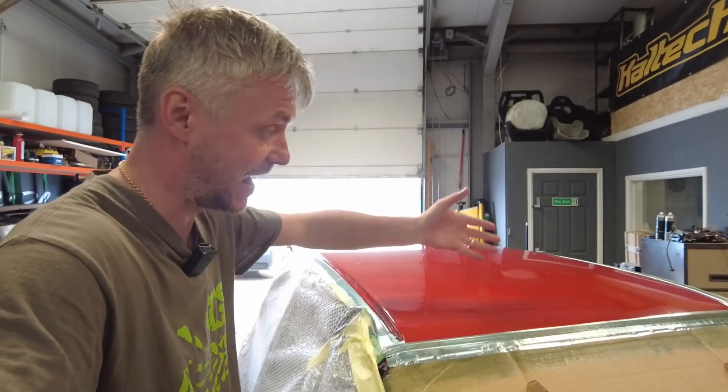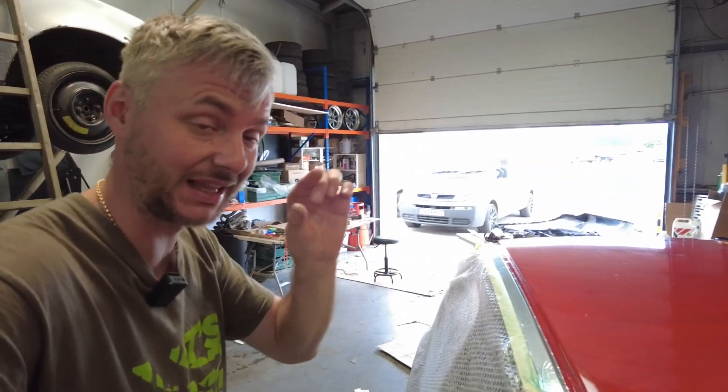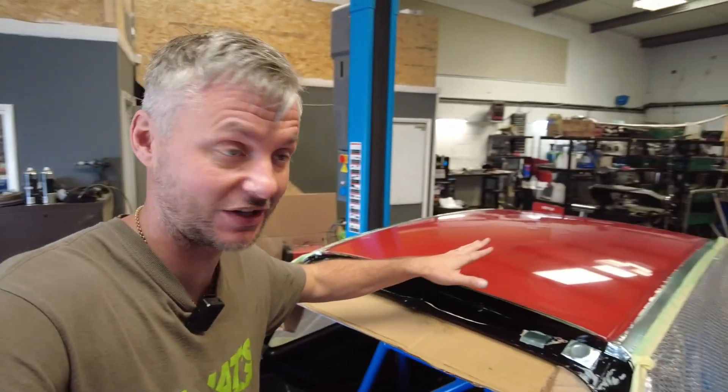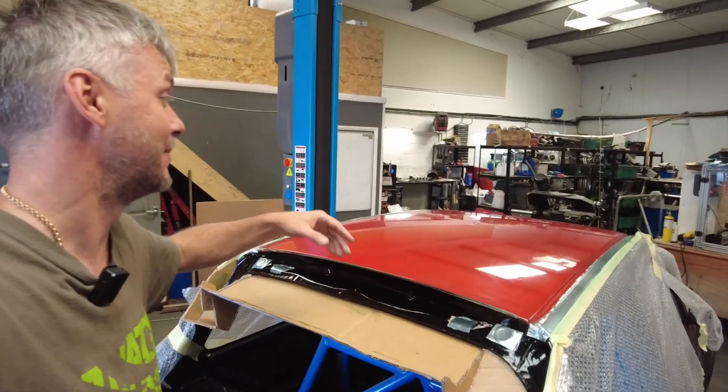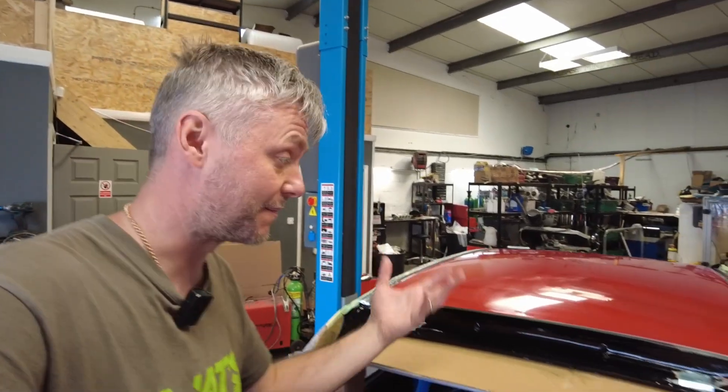You prep it and now you would lay 4 to 5 thick layers of fiberglass and then reinforce it. Actually, first you would obviously put gel coat and then reinforce it — but effectively this is how you make a mold. So we're not making a mold, we're skinning it.